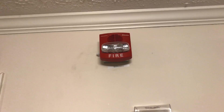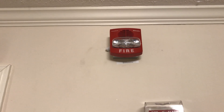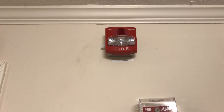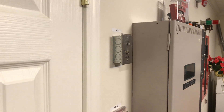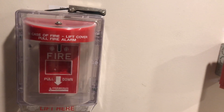The way these work: if you have the devices set on sync, the strobe will only fire as soon as the power is removed. It basically charges up and then as soon as there's any little cut in the power, the strobe will flash. That's why you'll see the LEDs on my NACs flash in time with the strobes — not because of a current draw, but because that's how the panel actually works. It cuts the power and that's what syncs everything. So let's go ahead and pull the MS-151: lift and pull.